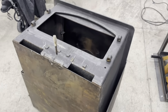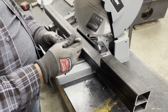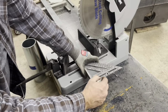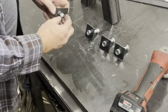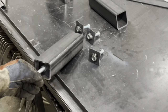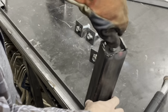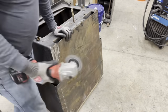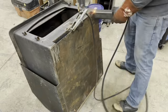That's a 15 degree angle and 9 inches long. We need to cut 4 of them. And this is a bracket for the leg leveler. Any uneven surface, you'll be able to level up your stove and make it sturdy. Getting it cleaned up and squared with a mark and ready to weld.